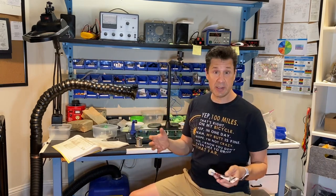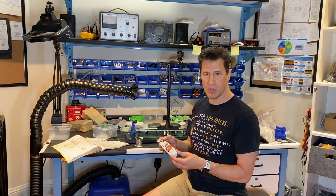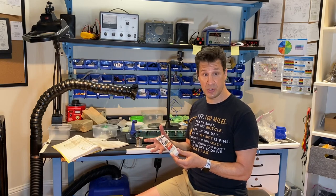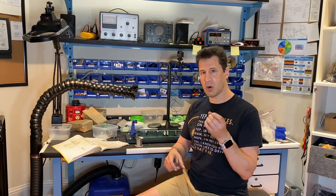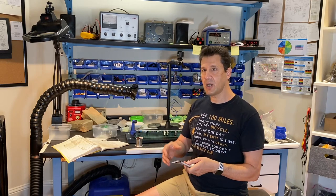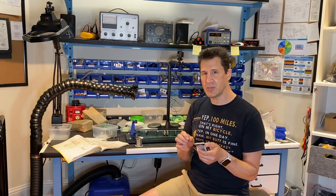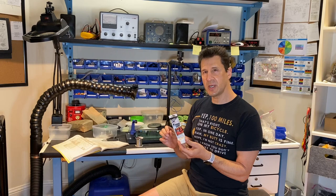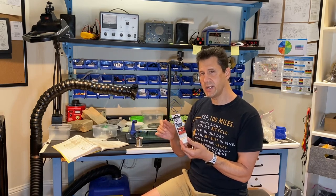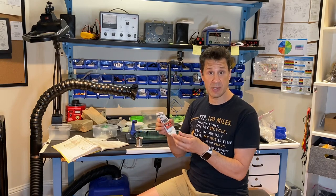What I did is, I'm a cyclist, and I use this product on carbon fiber components on the bike, particularly with the seat tube. Sometimes if you have a carbon fiber seat post that goes into a carbon fiber frame, the carbon fiber tube will slip. With carbon fiber, you don't want to clamp it too much. So if you use this paste, which has sort of a grit to it, you don't have to clamp down quite so hard, and you can protect your carbon that way, and the tube will stop slipping down.